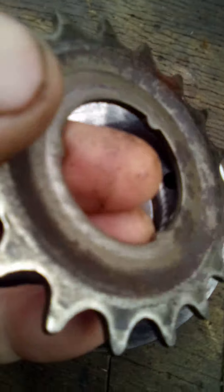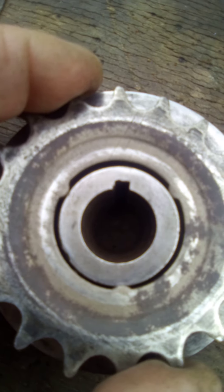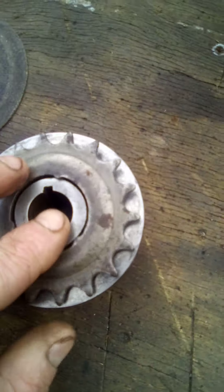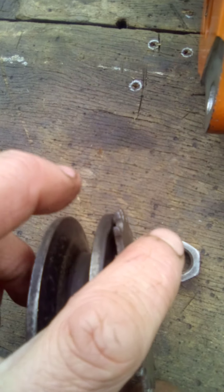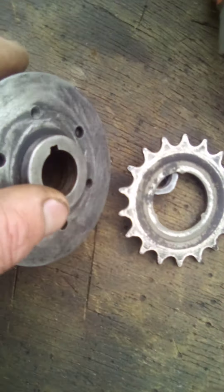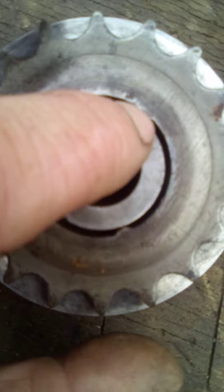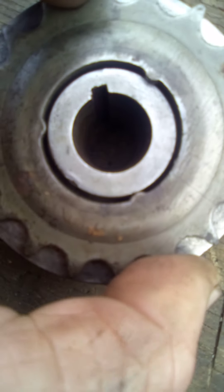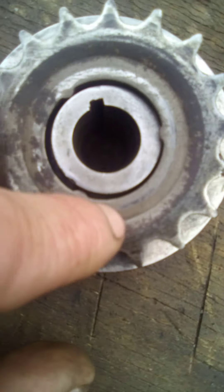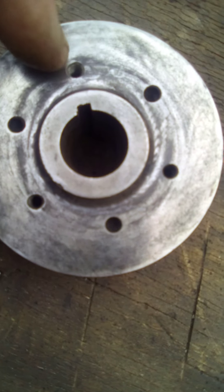What I've got to do here is — you see this recessed piece that's in here? You can see that this nearly fits on here now. This originally went that way, so we want the sprocket to go the other way. What I'm going to do is get the grindstone, grind those little tips down a little bit so it fits in there perfectly. Then I'm going to find something perfectly round that fits inside here and use that as my template — it should be smack bang in the middle of all these holes.